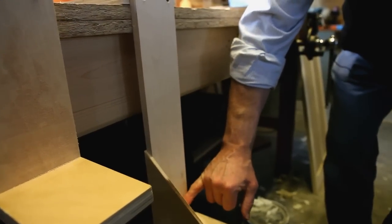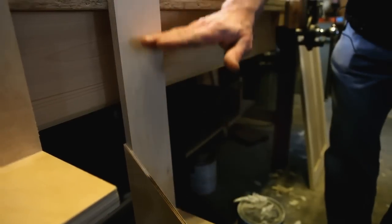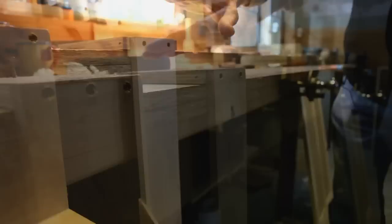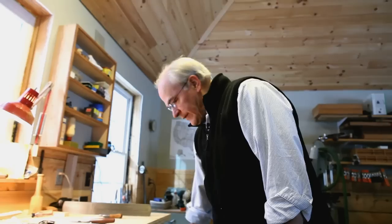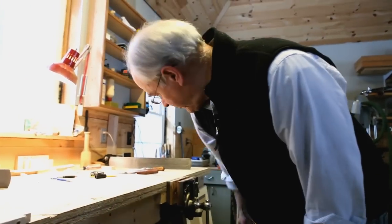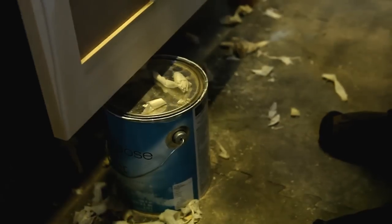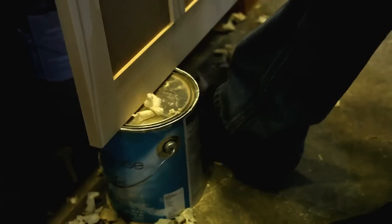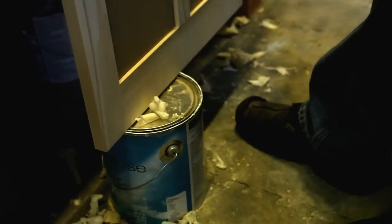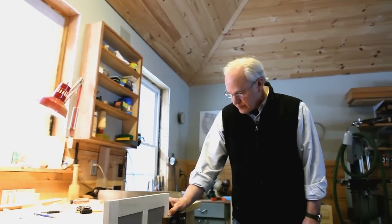This piece here can be sized to correspond with the width of the door, so the door just sticks up at a nice comfortable working height. I can move it anywhere along the bench to correspond with the height of the door. If I'm working on a door and trying to plane the very top of it, here's a one gallon paint can — put it in your vise like that, move the can out like that. You can plane on that and it won't droop in the vise, and the vise doesn't have to be that tight.